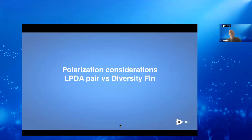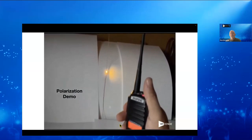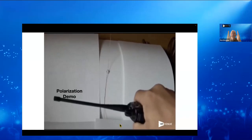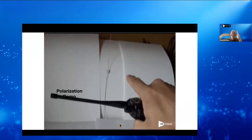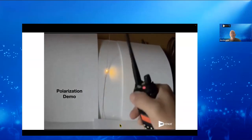So splitting your two antennas apart would be good, but we have to consider the phase of the signal, right? When antennas are spread apart, they're not seeing the same radio wave at the same time, and sometimes that's a real problem. There's a thing called polarization. When the transmitting antenna is in the same plane as the receiving antenna, you get full transfer. But if one is 90 degrees to the other one, you lose 99% of the signal.